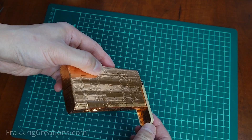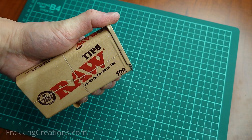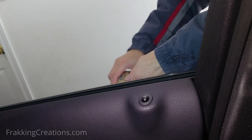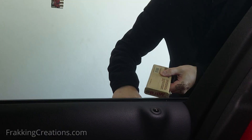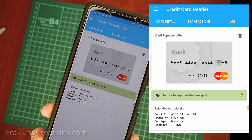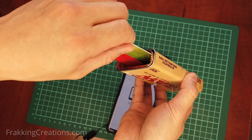Once your box is completed, always test. This pocket Faraday box will be tested using the key fob for the car and also using NFC credit cards. Initial testing showed that we only needed better shielding of the lid area, which originally only had two layers. After adding three additional layers to the lid, it now passes successfully. When tested on NFC credit cards, this also passes. We have finally achieved our objective of a fully functioning pocket Faraday box for key fobs and NFC or RFID cards.